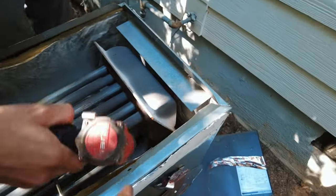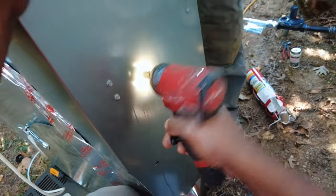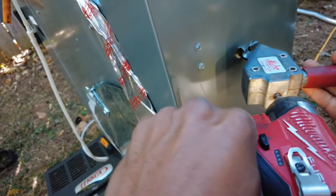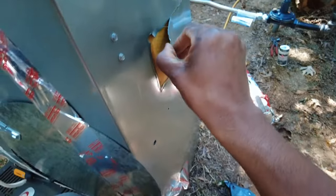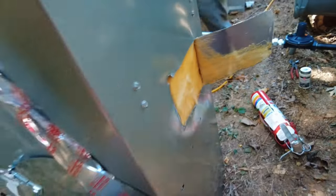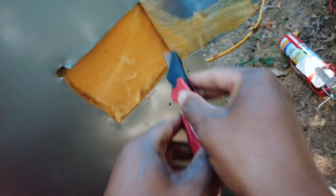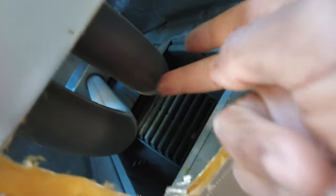Those flames can impinge at the back — you can actually see the back side of that heat exchanger looks toasty. We're going to go ahead and cut in the access panel so we can actually access the heat exchanger. Now we can see the hottest portion of the heat exchanger. We're going to blow holes into this section here, one at a time, and with this access panel we can do it and still see what's happening.